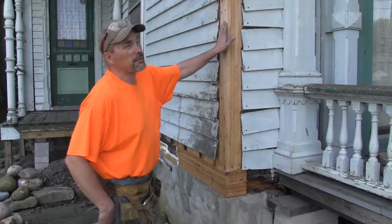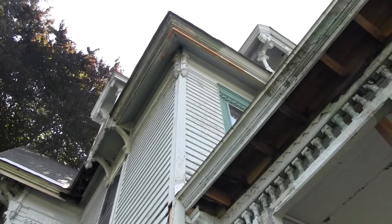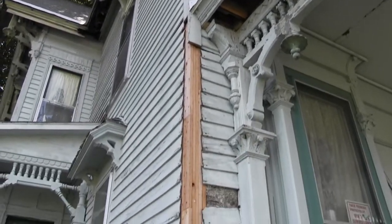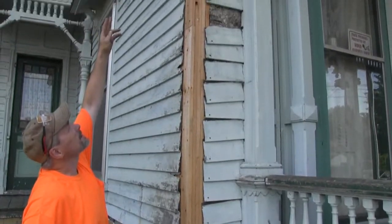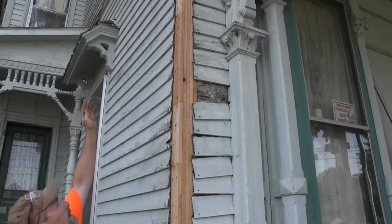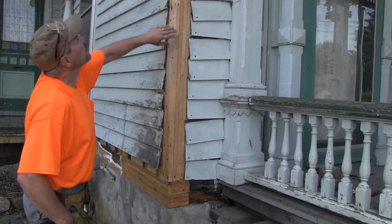Here we have an area up above the eaves where the drip at, not the gutter. At one point they decided to run it down the side of the building and into this. And what happened was it broke, and then the water was hitting this thing that was a nail, kind of a nail to hold it on. It was going inside and running down through here, so it rotted this whole thing out. So we had to remove it.